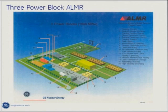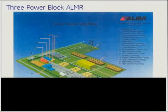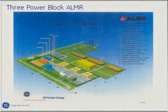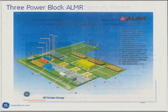This was an Nth-of-a-kind plant, where N was defined as having built about 17 reactors to achieve that order of magnitude cost reduction. The plant footprint is roughly 300 by 200 feet — not too large. One thing about capacity factors: if you have six reactor vessels running, your capacity factor should be better than a monolithic design.